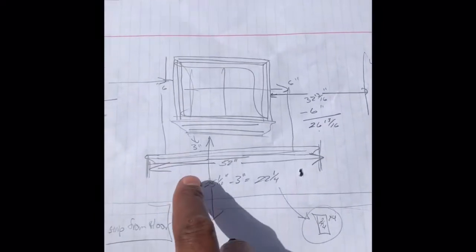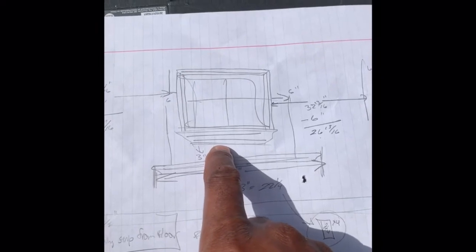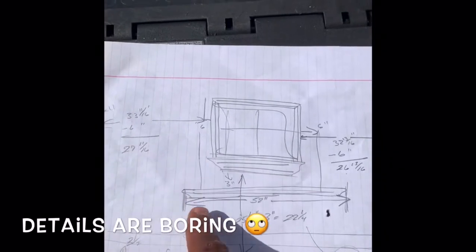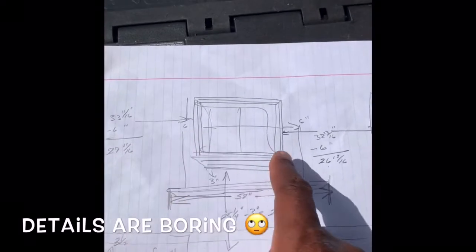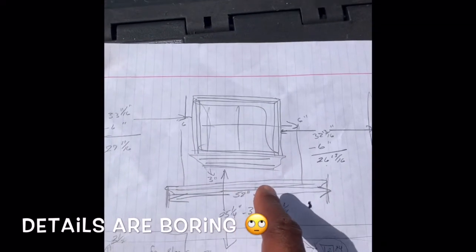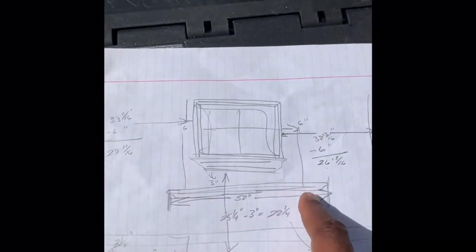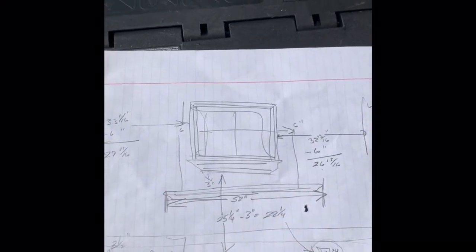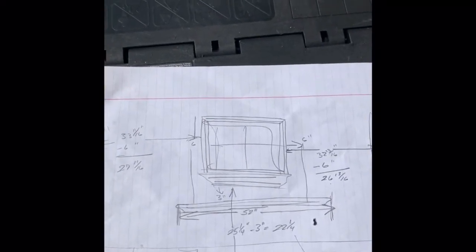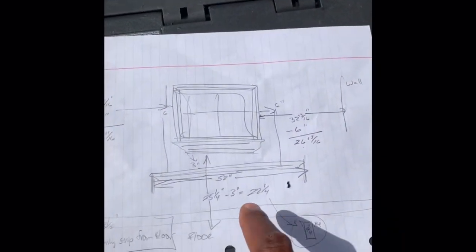I think I'm gonna come down about 3 inches from that window sill, and then on the sides I'm going to go out about 6 inches, because it's only like a 40-inch window. If she has to sit in that area, she might not be able to sit sideways. So if you add 6 inches on either side, you get 52 inches to play with, and that's even big enough for me to sit down, and I'm 6'4". And then the bookcase will go up on either side. So that's what I'm starting with.